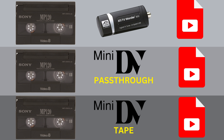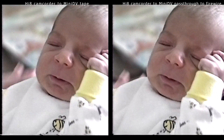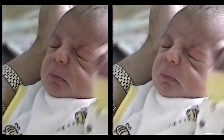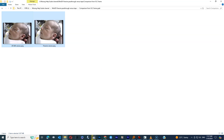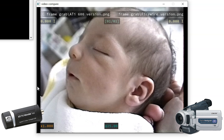I gave you some facts in the video and showed you some samples, but what does it all mean? First, I don't see any difference in the visual quality between the DV pass-through method and the DV tape method — I read that the pass-through method was better, but I don't really see it. For reasons of convenience, I will use the pass-through method from now on. Secondly, I don't see any difference in visual quality between the DV pass-through method and the ATI600 method. I know the conventional wisdom is that the DV method will cause your video color space to be compressed — that's the 4:2:2, 4:1:1 thing. They look pretty similar to me, although when I compared more closely, you can tell that the FireWire version is a little bit blown out — we're losing some detail in the whites that we're not losing in the ATI600.